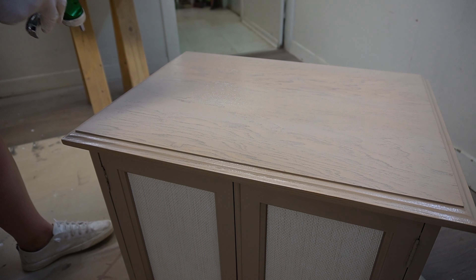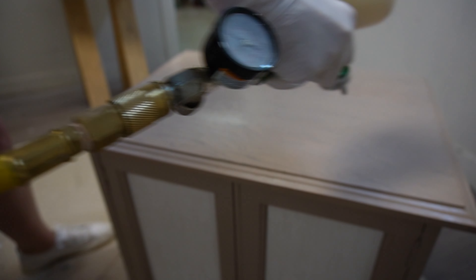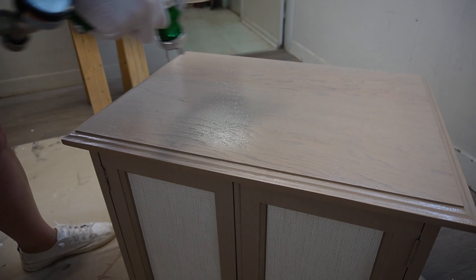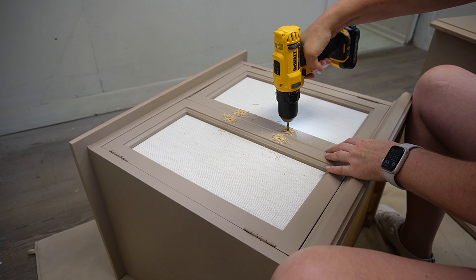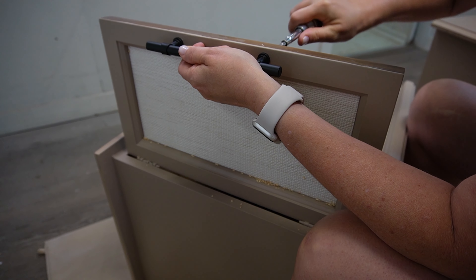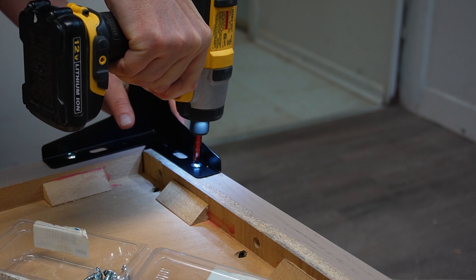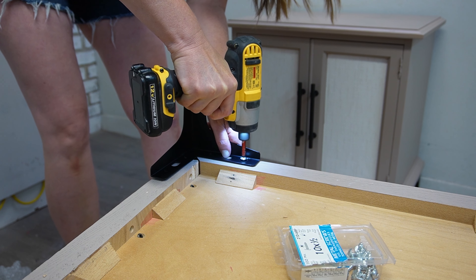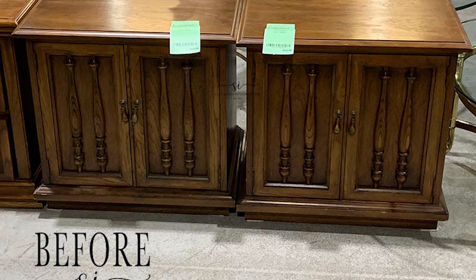It's not like I have to wait overnight or a couple of hours before I can actually start painting — it's a huge benefit when you're on a time crunch. Just like with the Bondo, it's a benefit and a curse because it dries so fast you have to work very quickly, and you can't dawdle while priming or it becomes a sticky mess. I have a full tutorial on how to use BIN shellac based primer, which I'll include in the cards above and in the description down below.